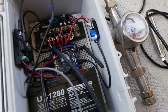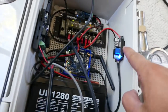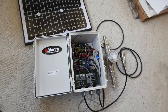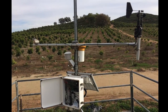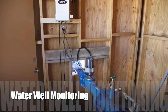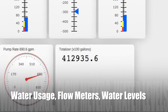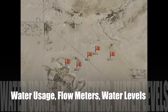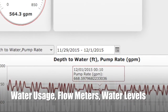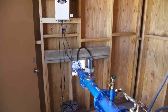This video features a water monitoring box we made for a customer in California. They're a large environmental consulting agency that monitors water, air, and other environmental factors around the United States. The Valarm box built in this video is used to monitor water wells. Water usage is monitored by water flow meter sensors, and water levels in the wells are monitored by pressure transducers or water level sensors installed deep down in the water well.